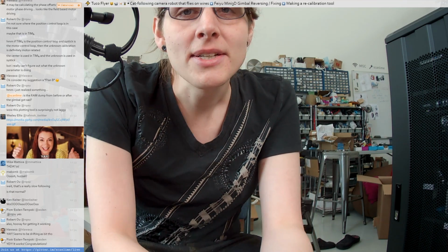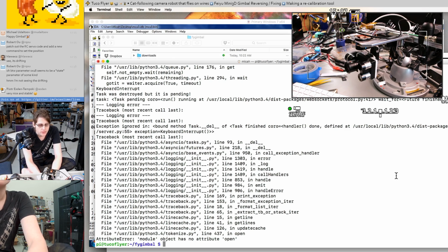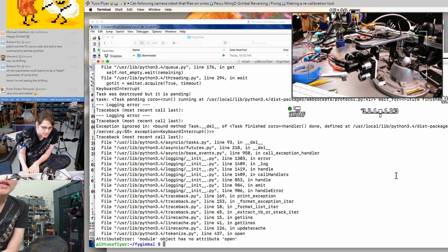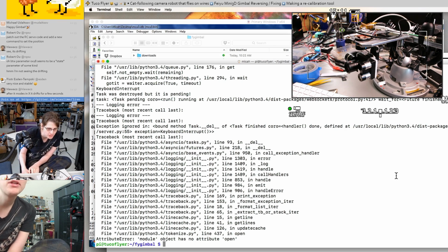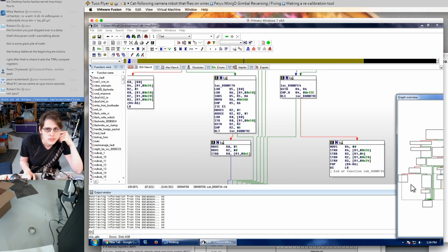So there's still some question marks as far as controlling it properly over the serial protocol. The firmware that's responsible for the PWM inputs, that's normally disabled when I have that in serial mode, I think that is calculating basically a velocity at some point that the loop integrates. And so I think I probably just need to figure out where that is and set it to 0 or set it to the value that I want.